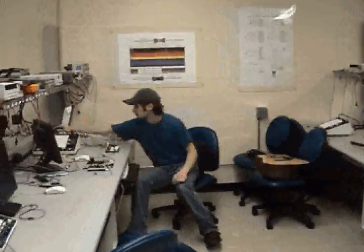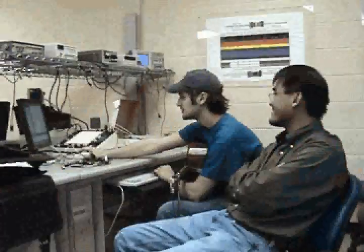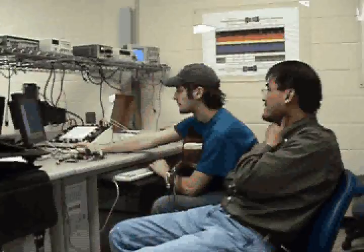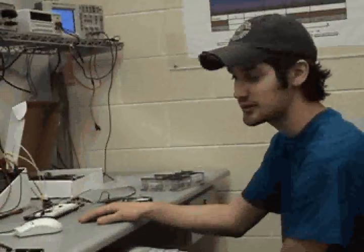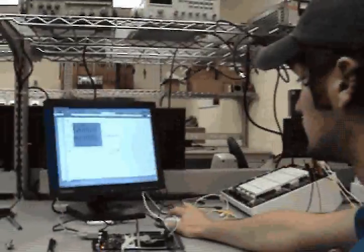My name is Jeremy Mazzini. My project is a guitar tuner. I use a microphone — it takes the input from the microphone and op amps, analyzes the signal, finds the zero crossings, and outputs the frequency. I'm getting it to the point where you can see what note is played and how close you are to the exact note.